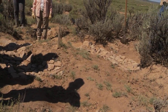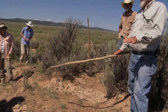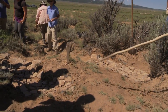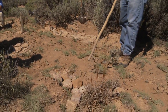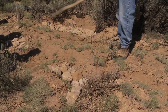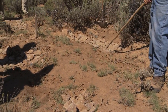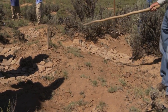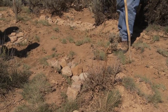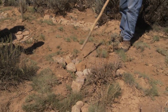There's a little secret here: head cuts tend to progress up valley as a set. We just fixed the obvious one — something was clearly going on here. But the set includes this little area up here where the topsoil is the first thing to go because it's the finest. There's a little drop and the A horizon washes away, then we're down to the B soil horizon. We get a deeper, more obvious cut at the B horizon and fix that, but don't notice what's happening in the A horizon. Head cuts are always going up valley as a set, so after you fix this, look around and see if you need to come up just a little further to catch that eroding A horizon.